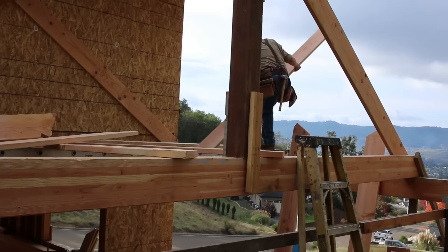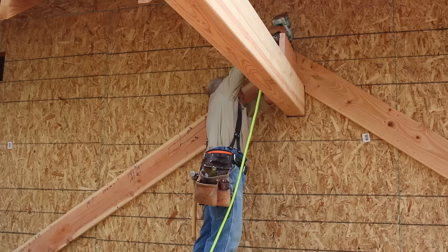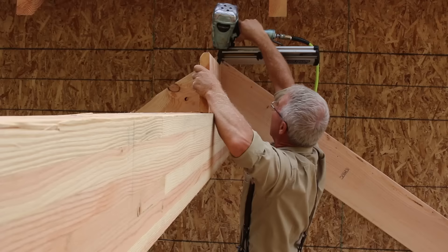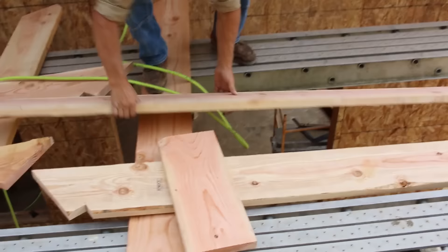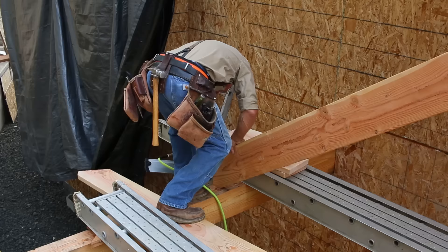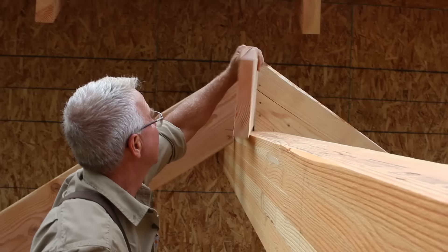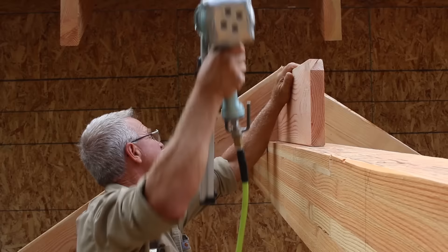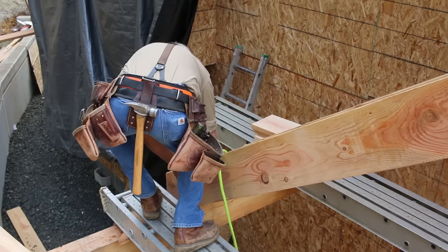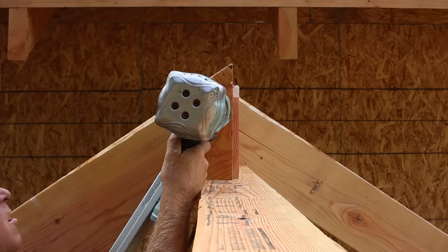A lot of the fastening when you're stacking a roof are toenails at the wall line, at the beams at the edge — shooting a nail at an angle to secure two pieces together. Toenails are not nearly as strong when not placed properly. Place your shot typically two from one side and one from the other. As a general rule, the toenail should go in at about a 45-degree angle, with half the length of the nail through the rafter and half into the beam or wall. A 16-penny nail is the right thing to use in framing a roof — ideal in almost every situation. In addition to nails, there are special hangers and clips that fasten rafters to beams and walls in a hurricane-proof way, and your plans may call for something like that.